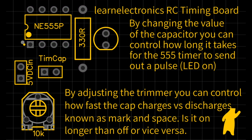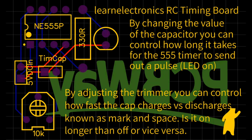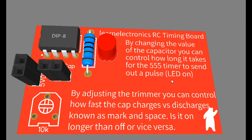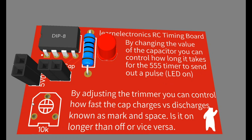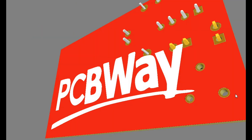Now I'm going to turn everything off except for the top silk layer so you guys can get an idea of what we've got going on here. This is our RC timing board — a simple 555 using the potentiometer to control the mark space and a variable timing capacitor, with some information on there for the kids to see. Here's a little 3D view of the board. You can see our 555 timer, the current limiting resistor for our LED, the female header to change the timing capacitor, the male header, and the mark space potentiometer.